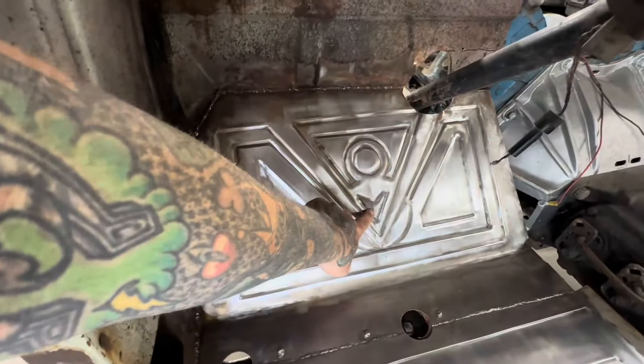Up next I'm tweaking my brake piece to fit inside the rear panel. I'm going to cut what I need for the excess to clear the lightning hole dimple die hole that's in the rear roll pan, just to make it fit. We're going to go back and forth on the shrinker and the stretcher to tweak what I need and mold it to that rear panel.